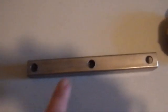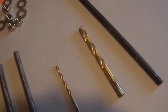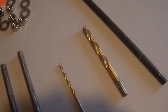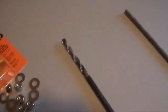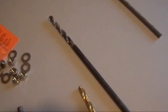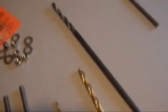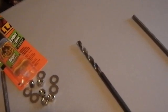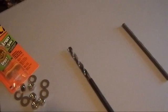The holes are now drilled in the cross piece. I started with the pilot drill, then went up to the next size which I thought was going to be the right size. It worked okay in the shaft making a nice snug hole, but did not work well enough in the square stock tubing because it's less forgiving. So I ended up having to use this rather long drill bit — the only one I have in that diameter. The only shorter option in that diameter is a wood bit, which I didn't want to use going through steel. I picked it up at a yard sale for about 50 cents, and it did me well today — that's all that really matters.